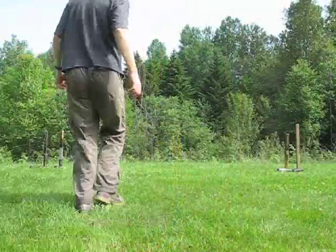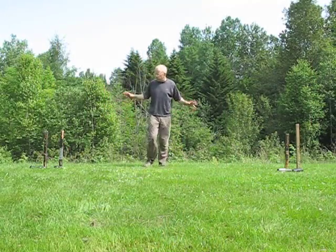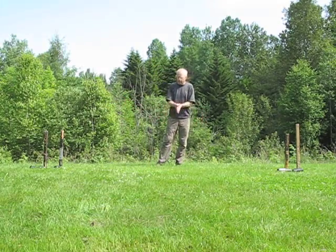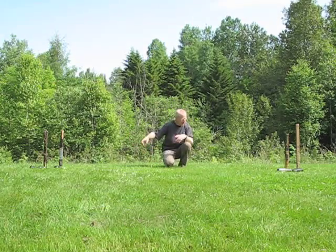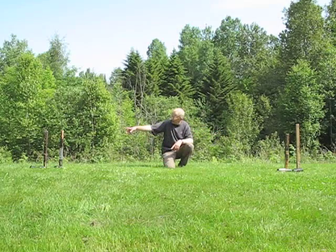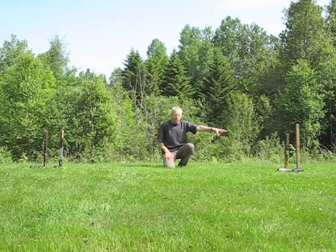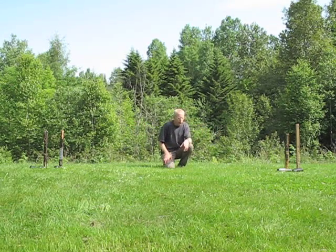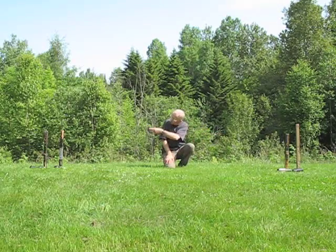All right, so in this video, if you can hear me well, I'm going to walk you through setting up a through beam. So in our reflector, when we were doing a reflector, a beam of light came from one side, hit a reflector, bounced back to the other side. So one light source and detector, and then just a reflector. On the through beam, we're going to have a light source that's just going to go straight through to a detector.